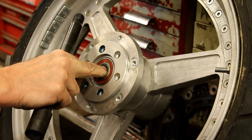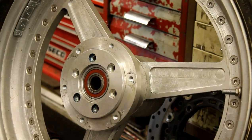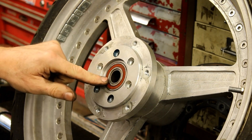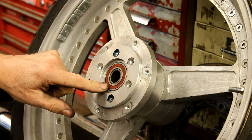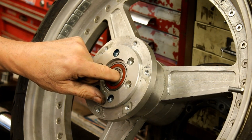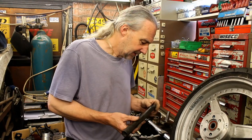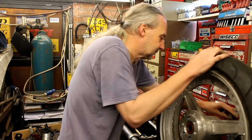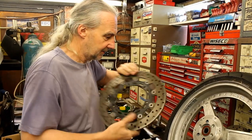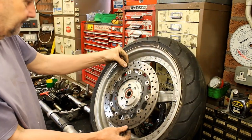You can see there's a spacer in the middle - check it. What you do is get the spacer out and probably put another spacer in that's a bit thinner, or we might be able to get bearings that have got 22mm. We've also got to remake the disc mounts. If you grab one of them discs we can have a look - it's not a problem, it's just more work. Basically we're going to be making a couple of carriers up.